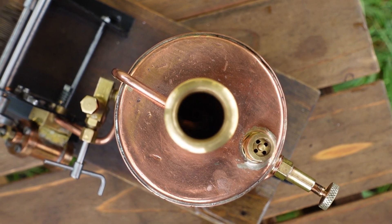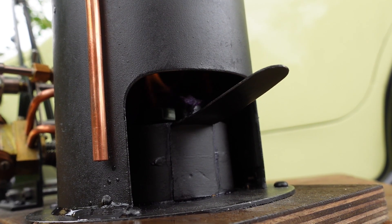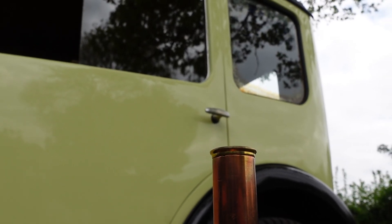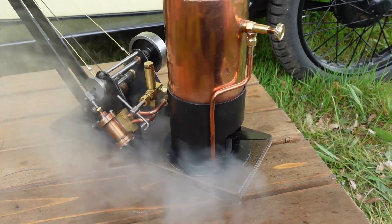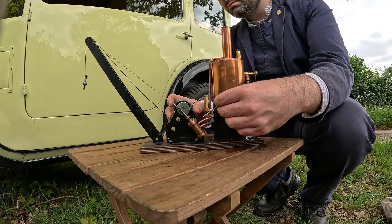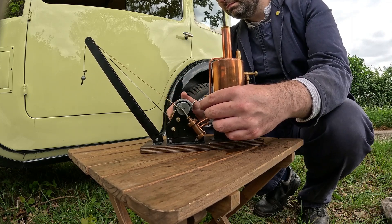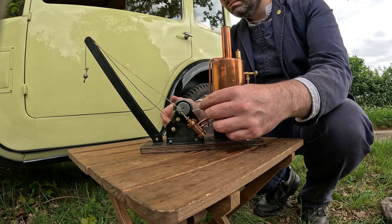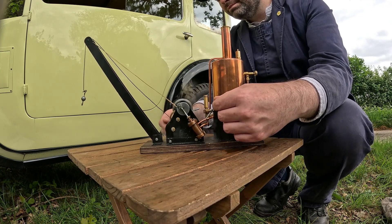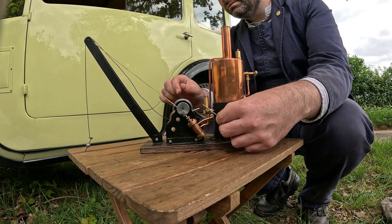We'll light the wicks — you can't really see it in this image but they are alight, I can assure you. If you look down through — it's got a single flue, this boiler — you can see the flames down below, so we know we've got heat. Now it's a case of waiting for pressure to build. Once we have steam you can see it coming out of the valve here, so we just close that off and let it build up some pressure. Once we're up to pressure, which normally takes around three or four minutes, we can start to see if the engine works. The engine will prime to start with as the hot steam enters a cold cylinder, so you'll get water in there, but once it's all warmed up nicely it will run absolutely fine. And as you can see, we now have power.